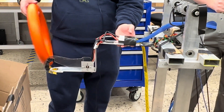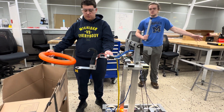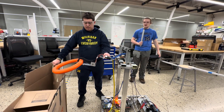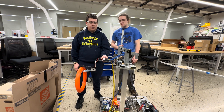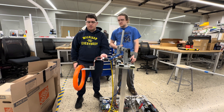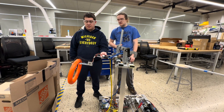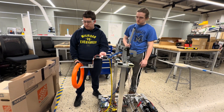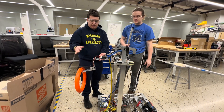Can we get somebody to actuate the robot? Let me put my safety gloves on. The claw moved up — it worked. And then down. This is kind of the idea. You pick it up like this off the floor, and then it kind of hangs down, and as you lift it up — which is the other disappointing part — it doesn't actually get to the real amp height because if the carriage can move all the way up, this would be at the correct height. That's another design flaw with the elevator to add to the list.